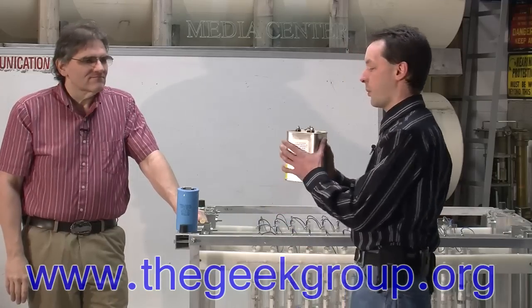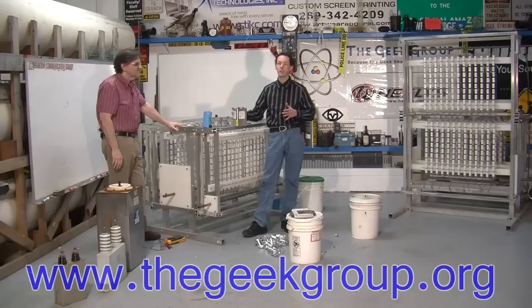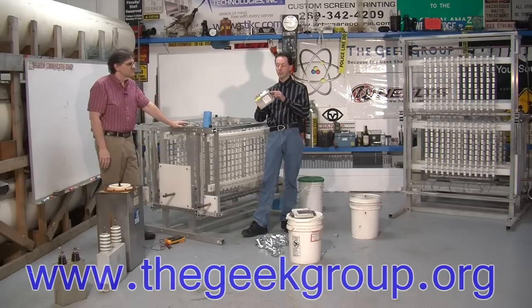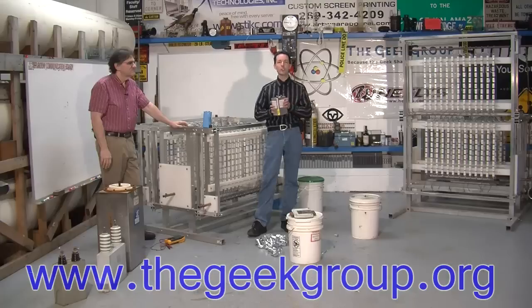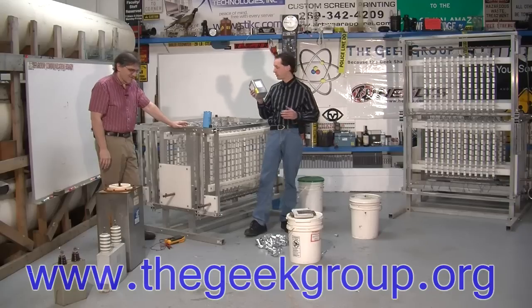Now, basically what I want to cover is so that you guys can identify the differences between what these are and what you want to use and what you want to stay away from. This is a PFC cap. It's useless for Tesla coiling unless you're putting it on your power supply side. You don't want to use this as part of the tank circuit. It'll blow up. You'll notice this one is a metal box, and there's the little fill hole on top where they put the oil in. This has no venting. If you use this in a Tesla coil, it will overpressure, it will explode, and it will be a grenade. So don't use these.